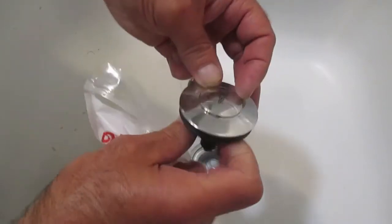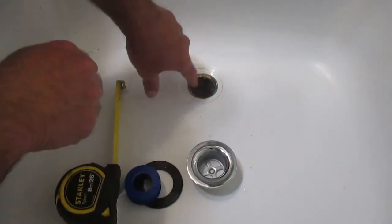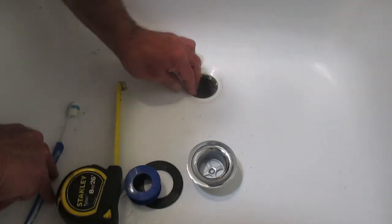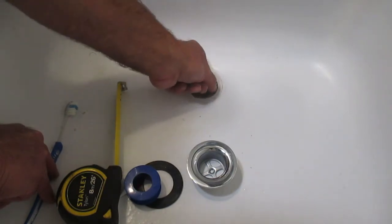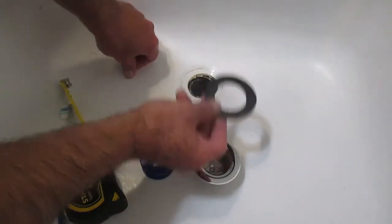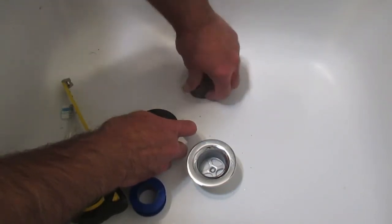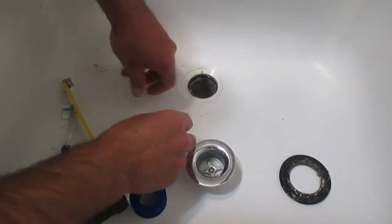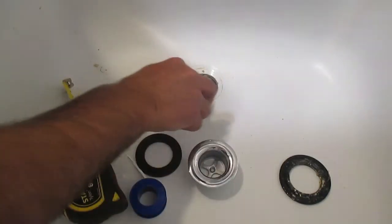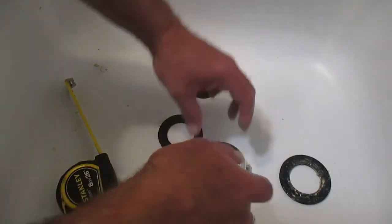What I'm going to do here is clean our drain out with an old toothbrush. I'm going to fast-forward to a certain point so you don't have to watch the whole monotonous process. Basically what we're going to do is put our new gasket in — this goes underneath the tub. Here's our old one. You could probably reuse it if you clean it up, but it only costs a couple bucks. So we'll slip the new gasket in place underneath.